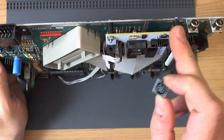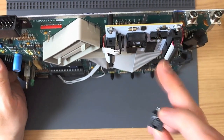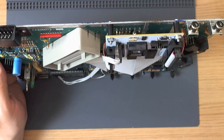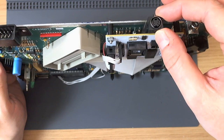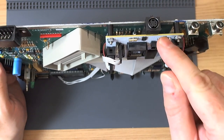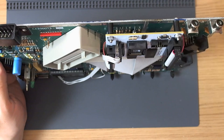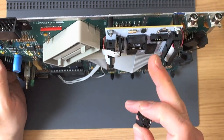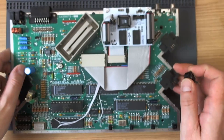I had thought that removing the RF modulator would kill the composite output on the XEGS, but it doesn't — I established that by temporarily lifting a resistor. Which was good news because it meant I could remove that horrible RF modulator, add S-video so the owner can use a straight S-video cable and his audio cable, while still having composite video if he needs it. The video quality, especially YC video, should be pretty good off this board. Wait — we've gotten completely ahead of ourselves here because this whole project was filmed in two halves and completely out of sequence. So let's back up a few days.